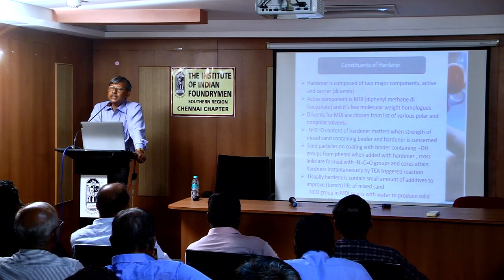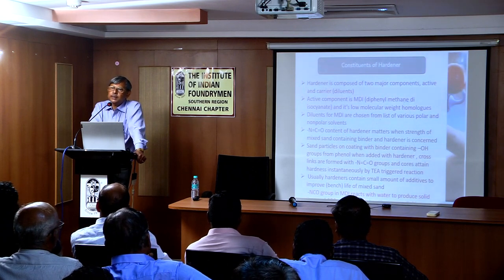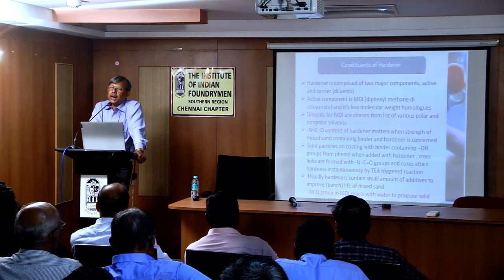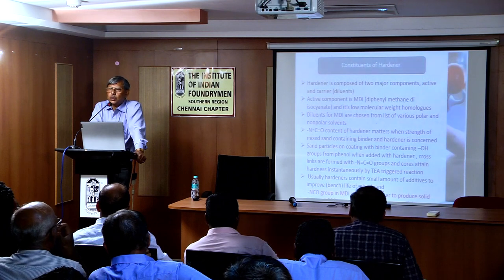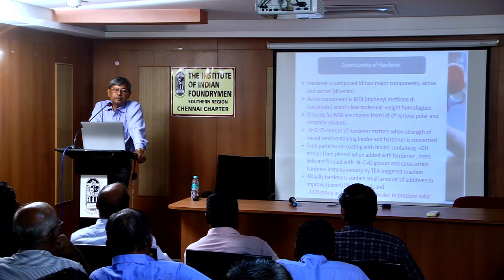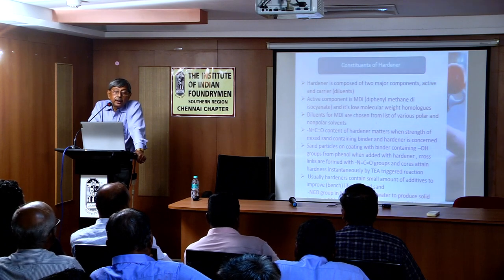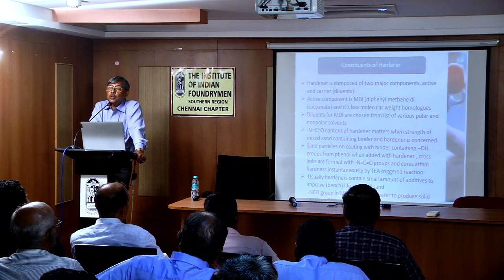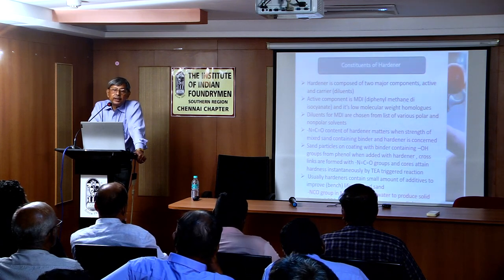Again, this solvent combination, polar, non-polar, depends upon the expertise or experience of the supplier. But in most cases, the MDI content of the hardener is 70 to 80% of the total, and the rest, 20 to 30%, is solvent. As I have told, the NCO content of the hardener is most important. You can check the NCO content of the hardener, which is the active component, and the other is a diluent.